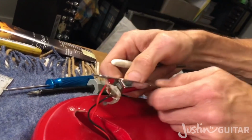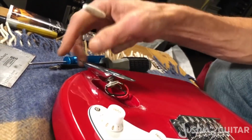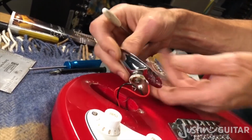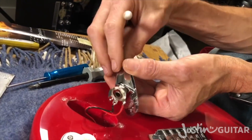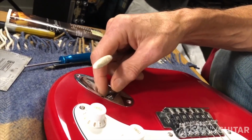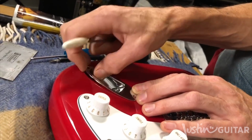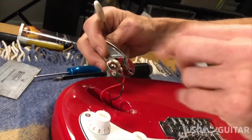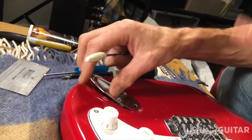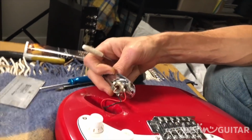And the reason it's come off is that over time, inserting and removing the jack plug from the socket makes the jack itself go loose. Then depending how vigilant you are, people tighten it up by hand. So this twists round, it goes tight, then time marches on, it gets loose again, and repeat, and eventually one of the wires drops off.